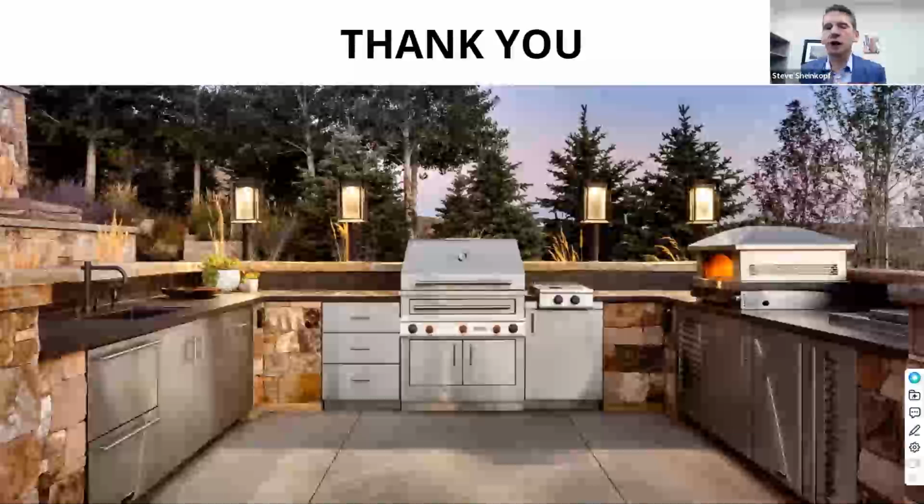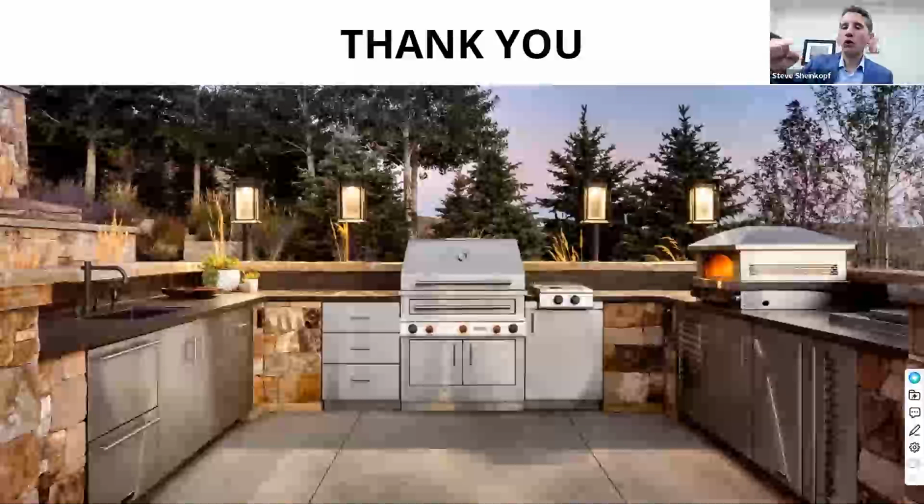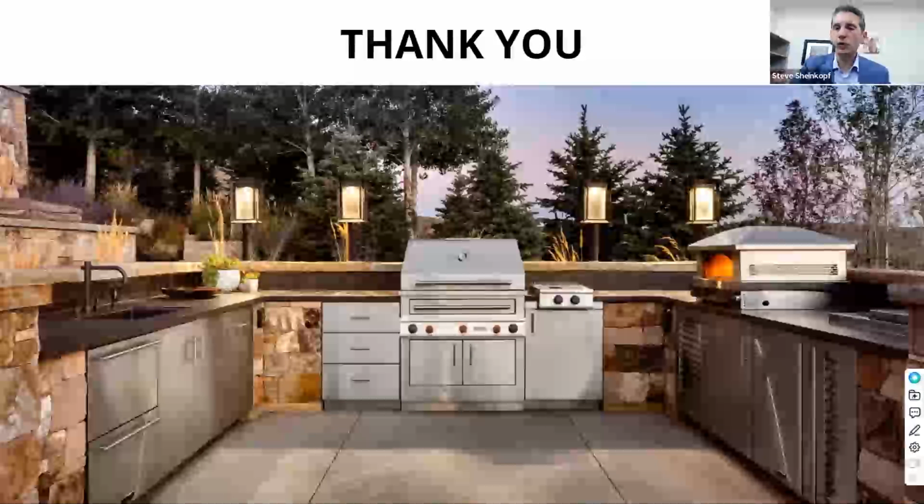The other thing you got to be mindful of, which we discovered that day, is to make the cover go all the way back. You have to have like a little flange of a couple inches, or otherwise it's going to slam against the wall. You got to make sure there's play there, right? So really the average grill is, say, 25, 26 inches. You need at least a 27-inch deep hood.